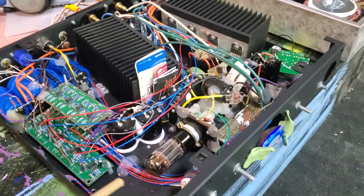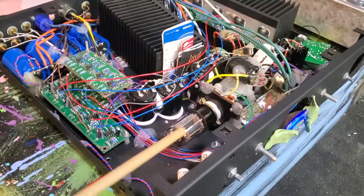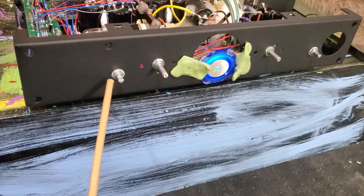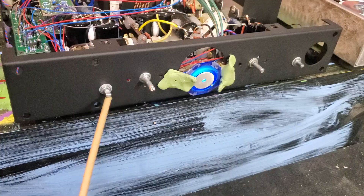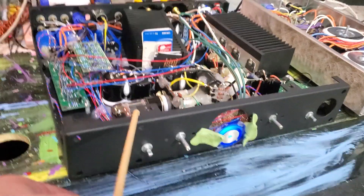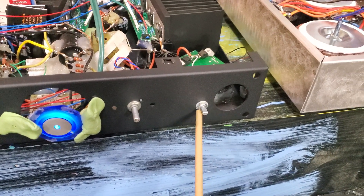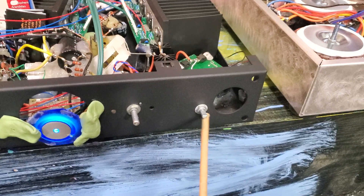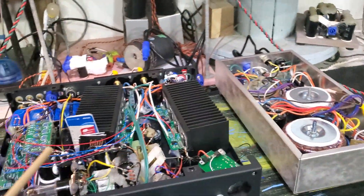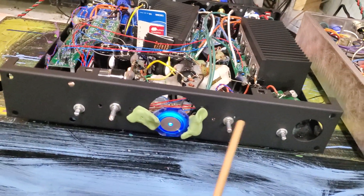The original ELDBD had a switch to switch this 6SN7 tube in and out of the signal path. In this case we did something better — this knob is an adjustable knob to control how much tube sound you want. The tube is continuously adjustable from zero to full gain in the signal path. On the other side, this knob is a solid-state knob. It's very similar to my model I810 integrated amp, but this is a smaller version due to the power supply, physical dimensions, and limitations. The function is almost exactly the same, with three inputs and a master volume control.